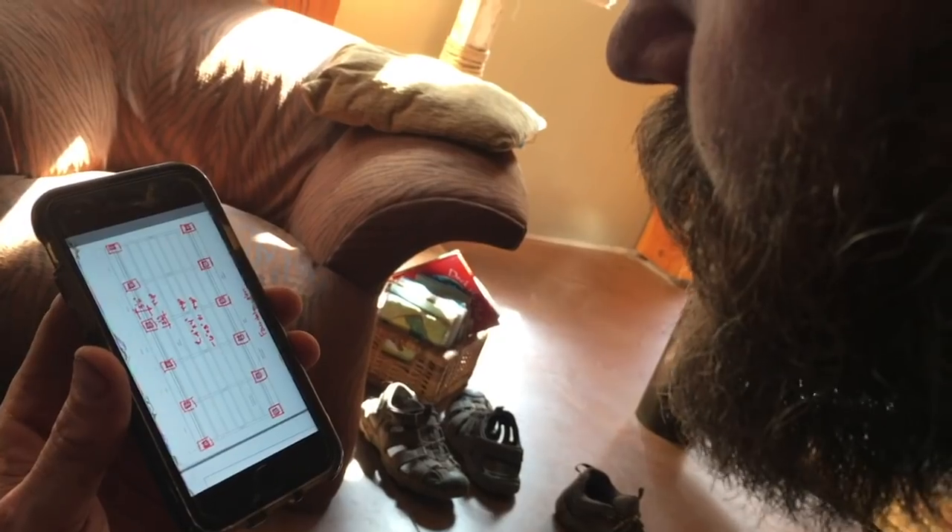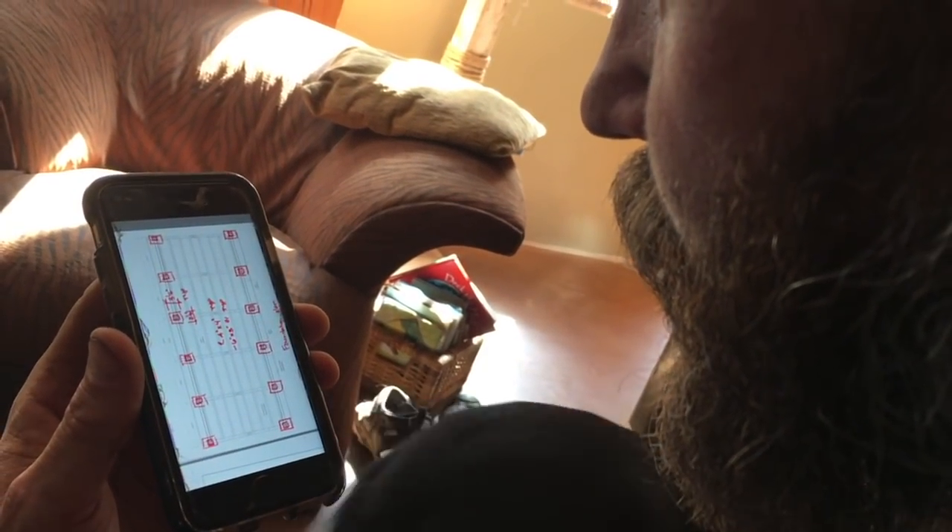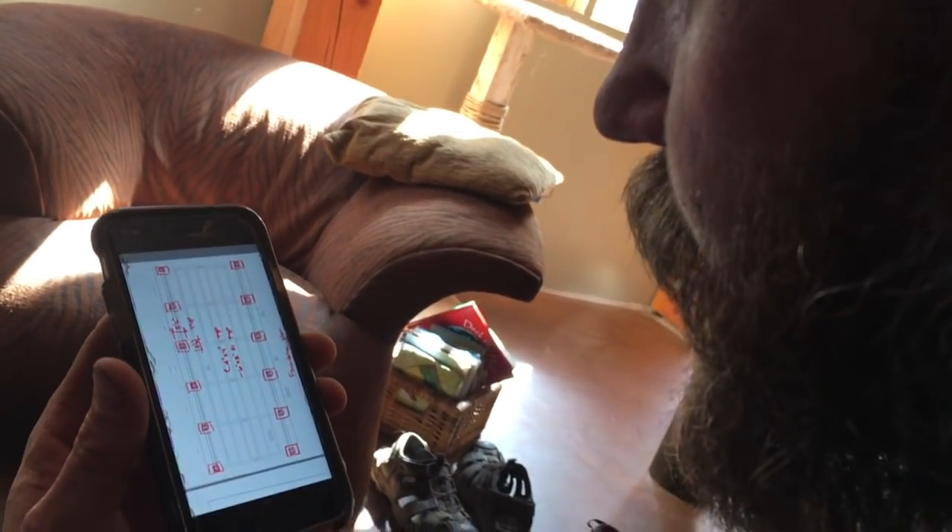I had done a lot of drawing on the shop — I had figured out sort of what I was going to use and how I wanted to do it. I didn't really finalize anything and I certainly hadn't run it past the engineer yet. So I got drawings all put together in a way that she could easily see what I was intending to do, and the engineer looked it over and got the drawings back to me. She didn't really suggest a whole lot of changes — she's just calling out some beam sizes. The main thing she contributed this time around was the foundation work. She really beefed up the foundation in order to minimize the amount of cross bracing I had to do in the rest of the structure.